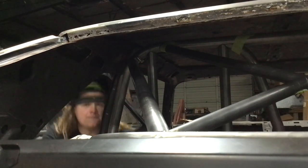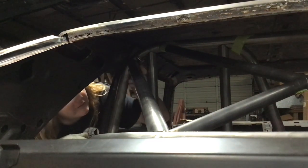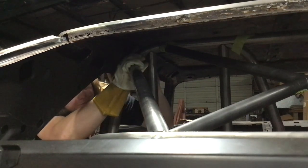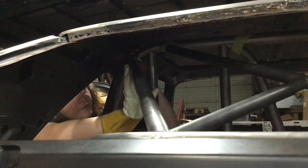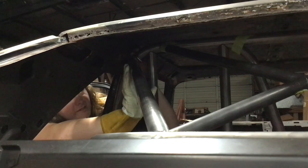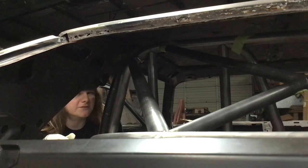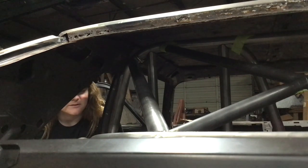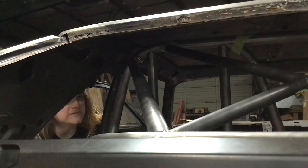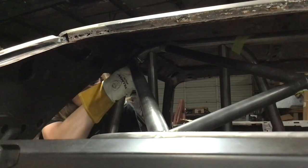All right. So I'm hoping y'all can see this hose clamp here, and how it helps establish where this particular tube needs to sit. I've used this pair of hose clamps all over this chassis just to make sure things are parallel and congruent and all the above, but they're really helpful here. I took a good amount of time measuring everything out to establish their locations on that main hoop there, so it really helps when you go to weld everything in, because stuff needs to be rigidly held in place, right? So I'll hold it and push my hand against it to make sure it doesn't move.